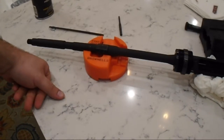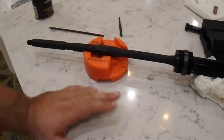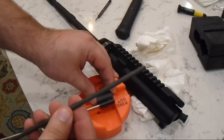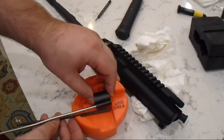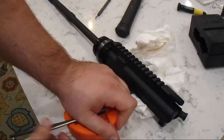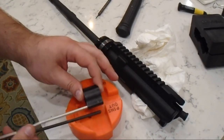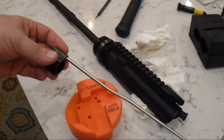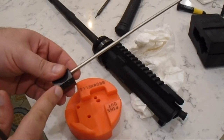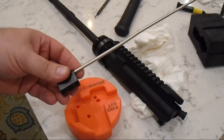It looks like I'm going to have to do this off camera so that I can secure this with my body or who knows. This is one of the hardest parts of the whole build. In order to finally drive the pin home, I had to use my gas tube clearance tool to prop it up, hold it down with my hand, and somehow line everything up and drive it home. It was very difficult and it took a lot of patience, but we got it done. Now all I've got to do is line everything up and use some Loctite on these allen screws — three thirty-seconds allen wrench — and then we'll keep moving from there.